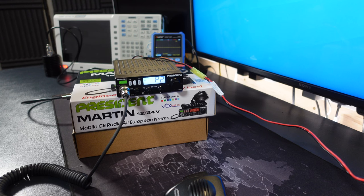Next setting is A2. A2 is only available in expanded mode, and this is the AM high power amplitude adjustment. Mine is 59 as my standard setting, and this should be adjusted to between 85 and 86 percent. Next you have AL, and this is the AM low power amplitude adjustment, available in the standard settings mode. My standard value is 49 for this radio, and it should be adjusted to between 89 and 90 percent.